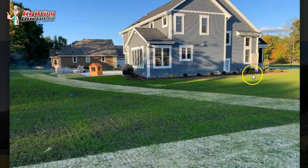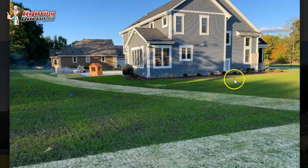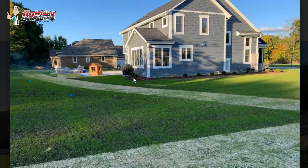Over here, I would have an uplight here for sure in the middle. This is where I would increase that beam intensity to that 35 watt equivalent, so I'm getting light all the way to this top peak. I would probably have one in the middle at minimum, maybe three along this side of the wall. I'd have another one over here between the windows to really make this window frame stand out. Then I would use those path and garden lights in between where I have my uplight — a path and garden light here, another one here, maybe two in here — creating that nice balance of uplighting with the bed highlighted down below.